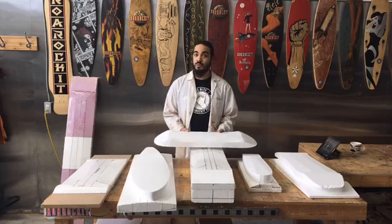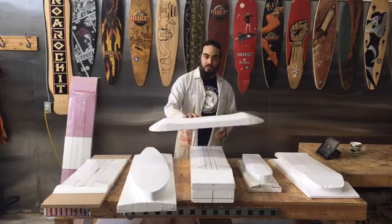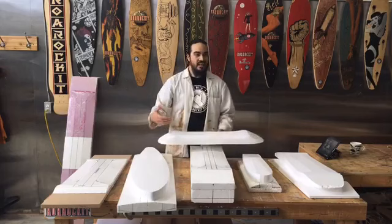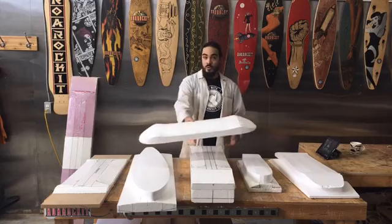This is a one-sided foam mold. It's made of foam, but it doesn't have to be made of foam. What's important is that it's a male mold only. You don't need to do a female part of the mold. When you're doing a concrete press, typically that's what you're getting into. You're going to make it out of concrete because you do need a rigid solid structure to force the material into the shape that you're going to want to build with. But you can always make a one-sided mold out of concrete and press that in the bag. Wouldn't recommend it, it seems heavy.